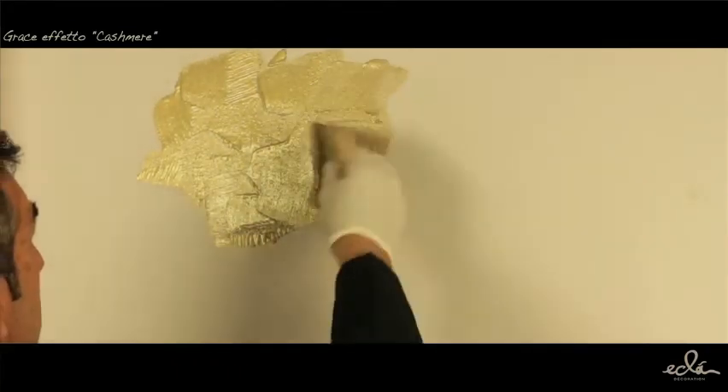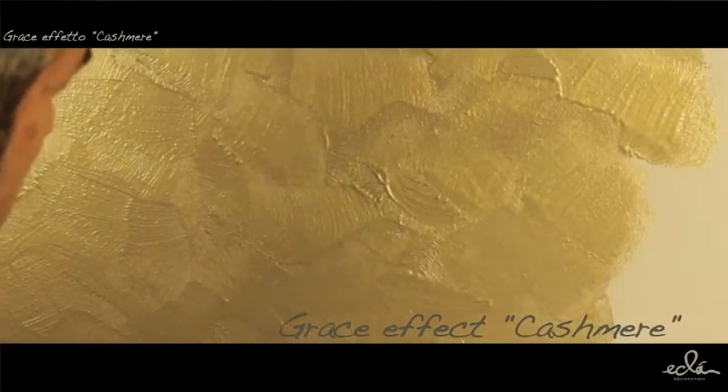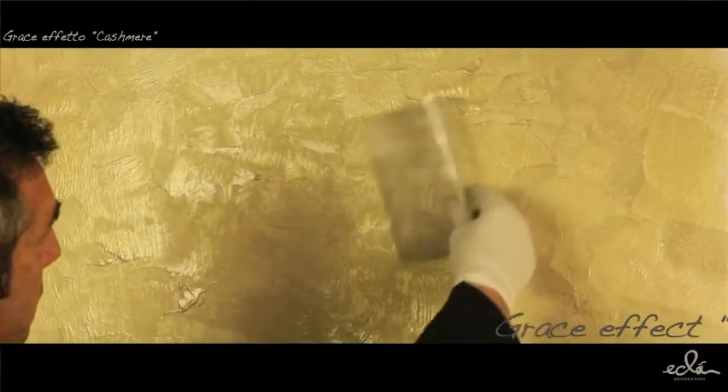Effect Stroke Crossed Spatula: Work on an area of about 2 to 3 square meters and continue the decoration to reach the matching part with brush discharge, so as to have no overlapping net of color and to obtain a homogeneous distribution of the product. After about 5 to 10 minutes, go over the treated surface smoothing with a double-blade spatula loaded with product, using criss-cross strokes.